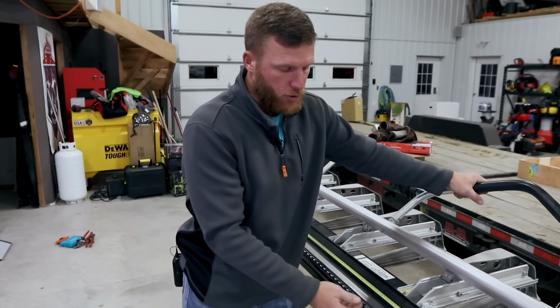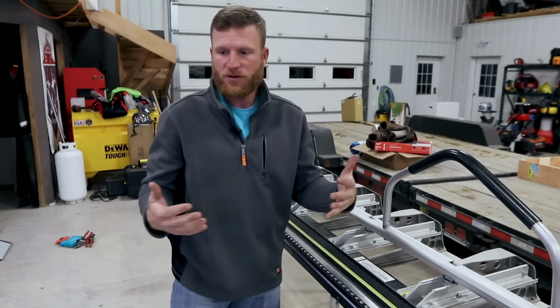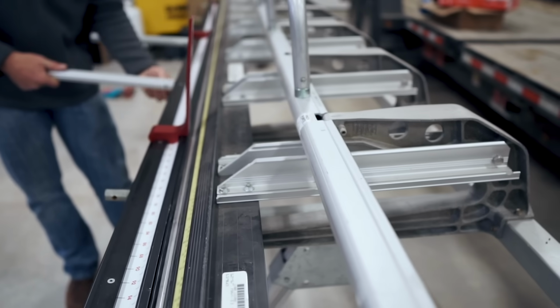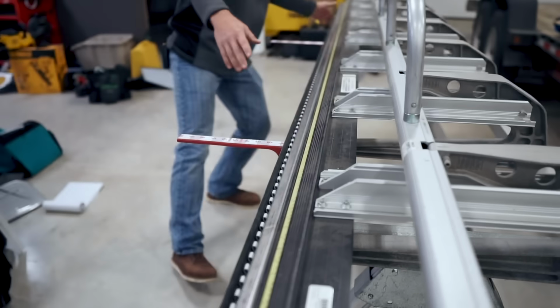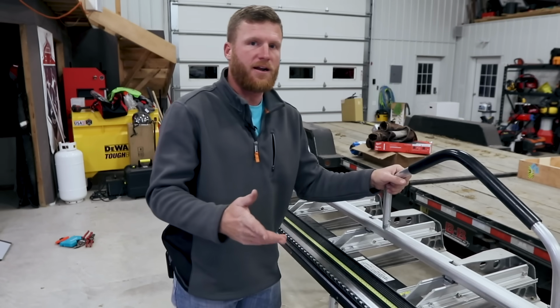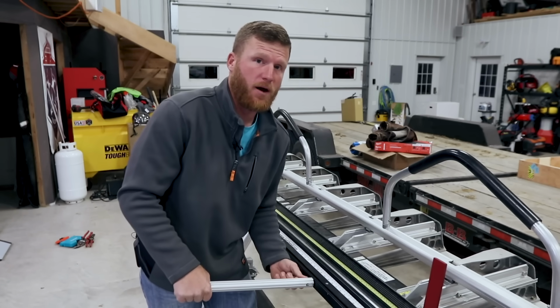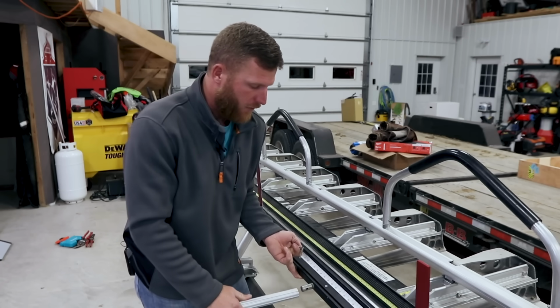Other than that, you've got a handle, and this is what's going to open your brake so that you can put your material inside, and then you're going to use it to clamp it down. Once your material is locked in place, you're going to use these handles down here, and these are all movable. So if you don't like it here, if you want it out here where you've got more material, or down here, you can move those around. There's actually a couple more that get stored in the brake, so that's kind of a nice feature, so that if you're transporting it, you've got these pins, and I haven't taken them off forever, so I just leave them in there. But you can remove them, and they do stick in the brake frame itself.